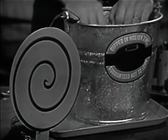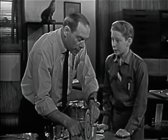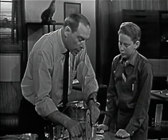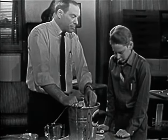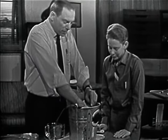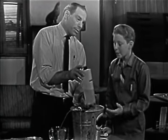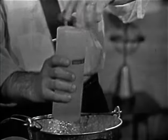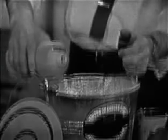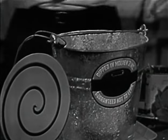Well, now, do you remember the trouble we had over there with our regular battery? Oh, what happened? We need a depolarizer. Well, let's put a depolarizer in. Do you have any potassium permanganate? No. You'd need something else. And the thing that you should probably use is laundry bleach. Laundry bleach. That was the opposite. Well, it happens to work quite well. So put in a quarter to a half a cup of laundry bleach. Stir it up a little bit.